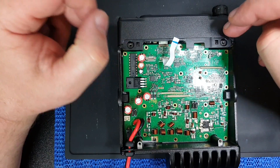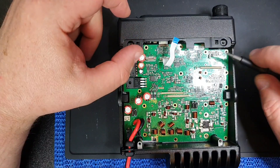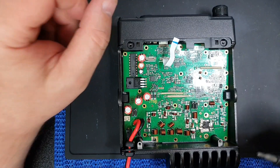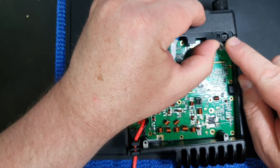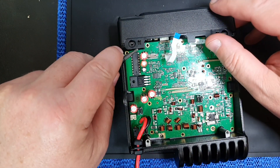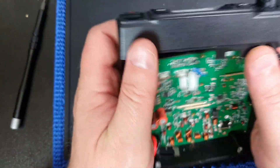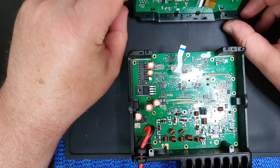This one has come in from a customer who said that it was actually DOA, which is actually fairly rare. The nature of the fault was very simply that it was shorting out when you turn the radio on. He said this was a fault from the box, but the reality is it's very unlikely that's the case — chances are he's actually reverse-polarity'd this radio.